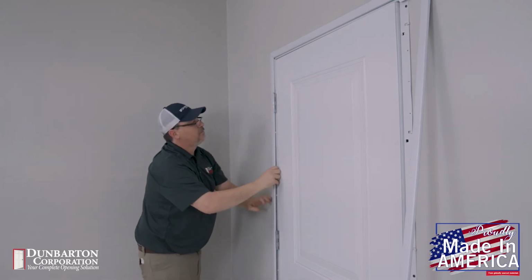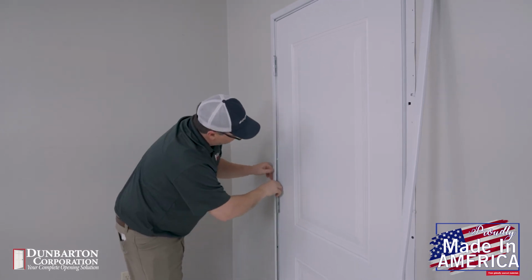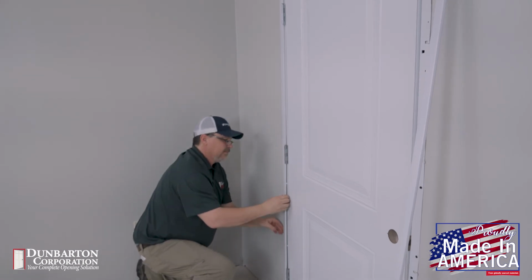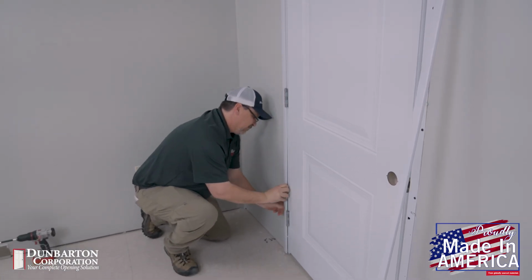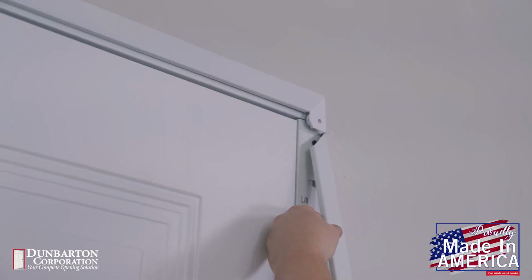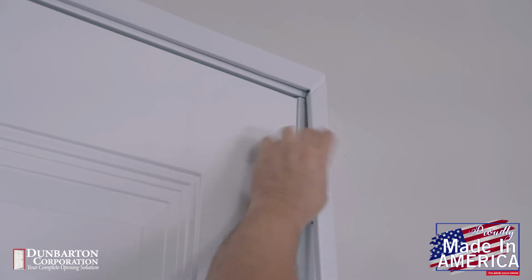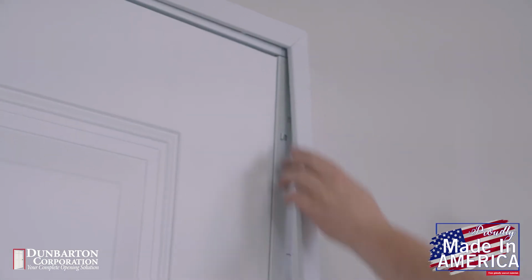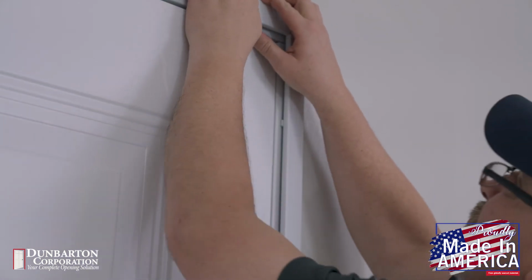This is important for maintaining a tight miter. Always remember to install the casing from the outside of the frame inward. Catch the edge of the casing under the outside curl of the lance and roll the casing inward using a slapping motion from outside to inside. RediFrame can be ordered with steel or aluminum casing or without casing lances to allow the application of wood casing of your choice. When wood casing is to be used, it comes with a round clearance hole to which the casing can be screwed or nailed.